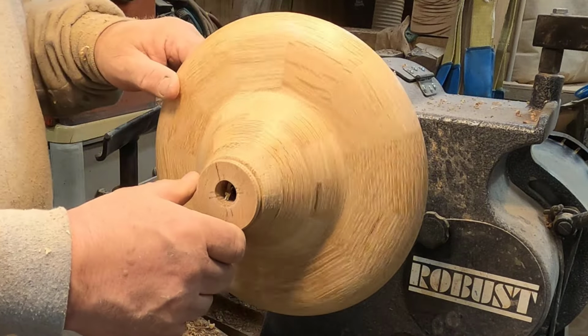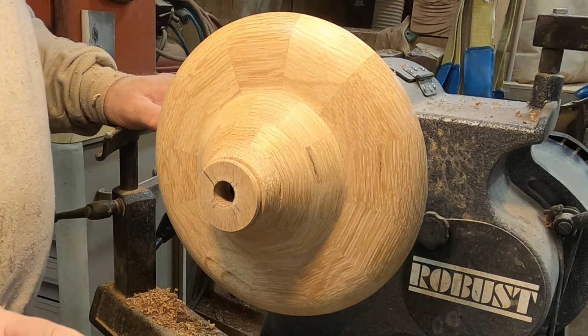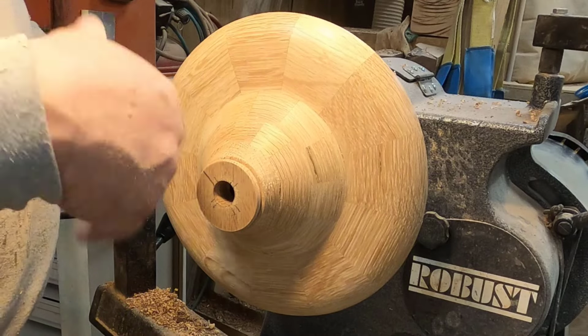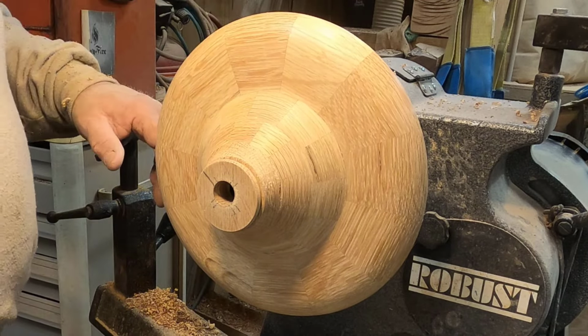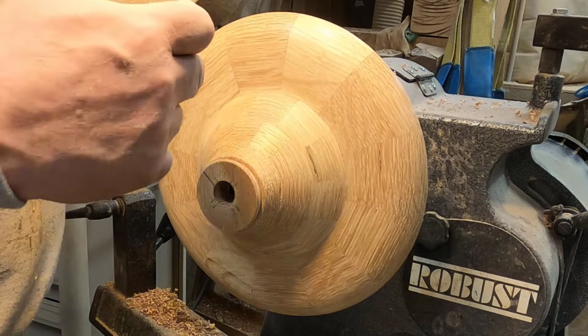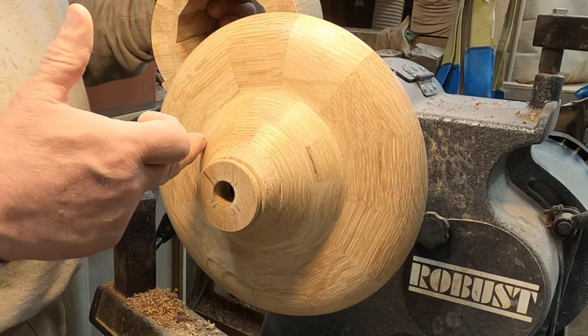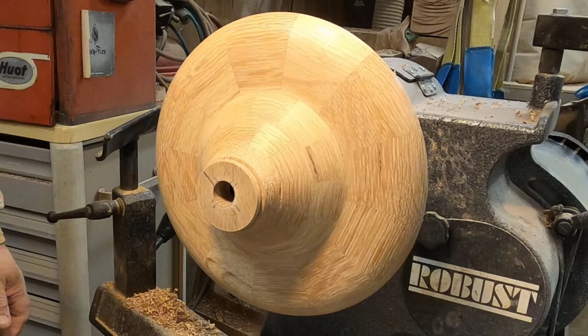So that's what I'm doing on this side. And what I'm going to do is take all 4 of them and get them to this point, and then I will work on the other side, which will be hollowing out the tray and marking where the feet of the body will be and where I can drill through. Then I will drill up through here and into here. With screws, I should say.